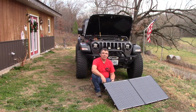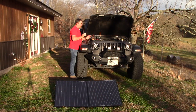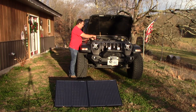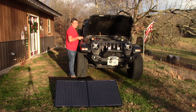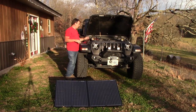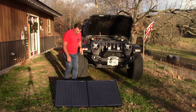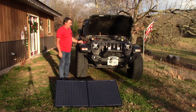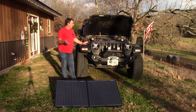We have got sun! Testing the power on the solar panel — it shows 15.12 volts. Of course it won't be that once we put a load on it. Our battery is at 12.25 volts. I've got the battery connected to the solar panel; it's not full sun but it is charging. It would just take a longer time, but definitely in a full day we'd get a lot of power. I also have my cell phone plugged into the USB and it is charging — there's a little lightning bolt on there — so the USB part works.